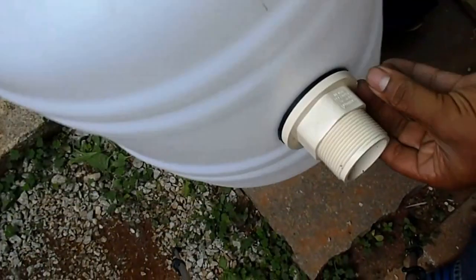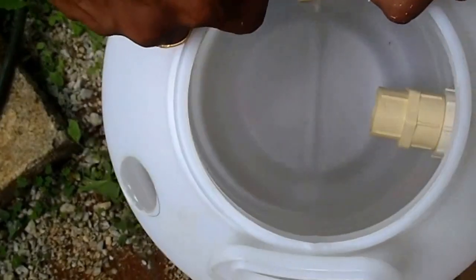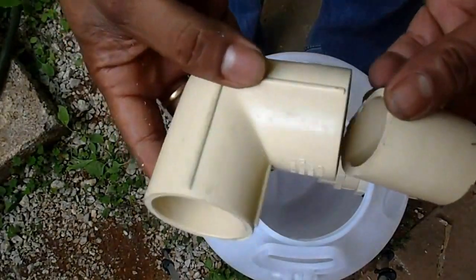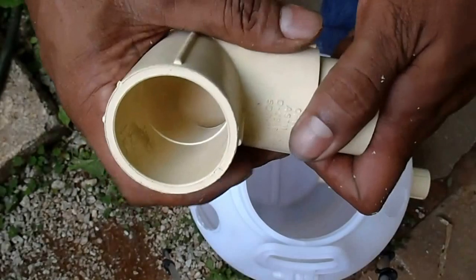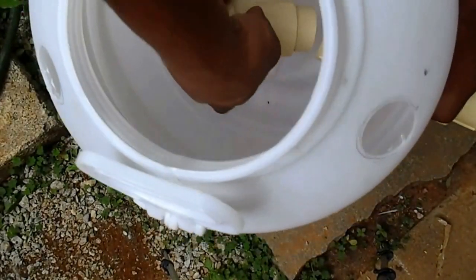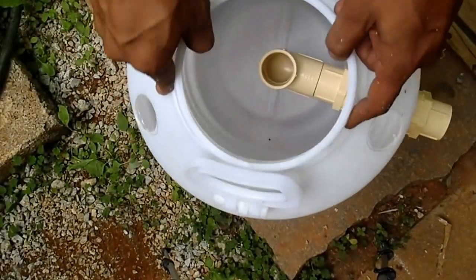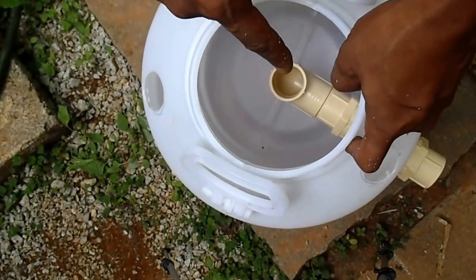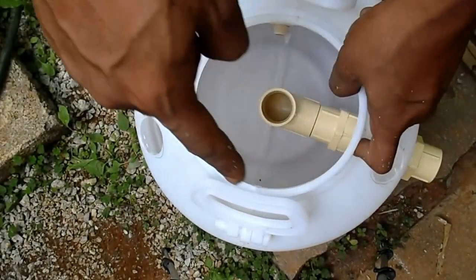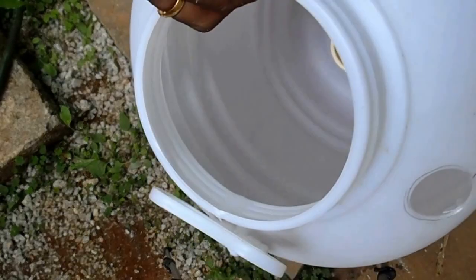That's tightened, and one more for the outside. Now to the centre, the pipe that's coming inside, I'm going to create a vertical elbow. I've got a 40mm pipe that I've cut — a small piece — and this goes in like that. Notice that this particular elbow is right at the centre. If you look at the outer circle, it has to be right at the centre. That's when the swirl effect will help the water go directly to the centre.